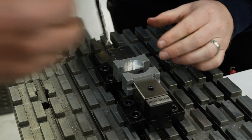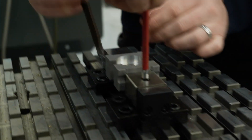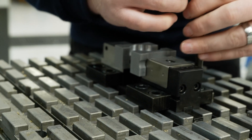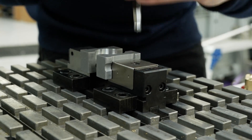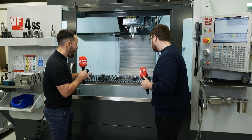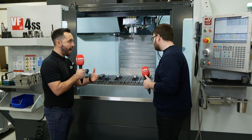For a very parallel part it's very simple. Using different step jaw sizes — you can get them in all different sizes — I traditionally use three millimetre because I don't want to use too much material. You see a lot of companies using a full 20mm but that's a waste of material and money — you're literally scrapping it. With this it's actually a very secure, solid system. On stainless steel I'm still taking fairly decent sized cuts while holding on two to three millimetres of material, and then you can switch it round and drop the full depth when you're whipping the back off.